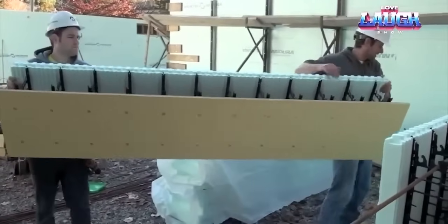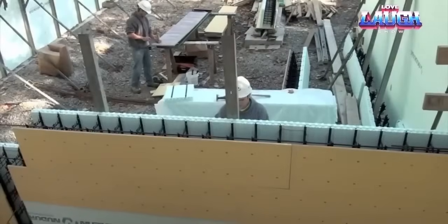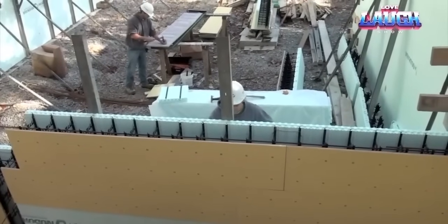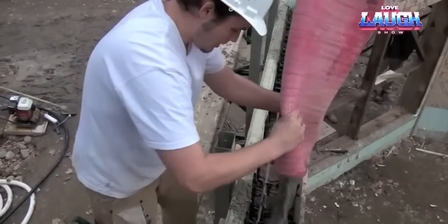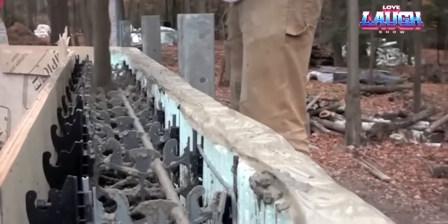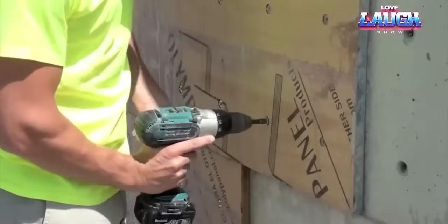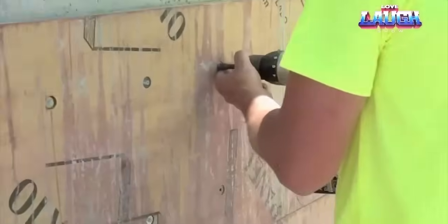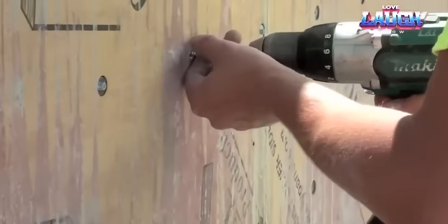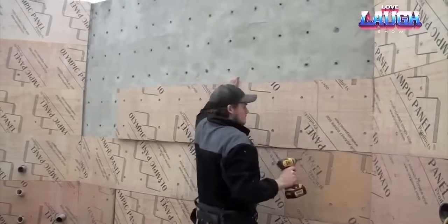Further, the construction process is reduced by one step. Workers are spared the need to remove the formwork after the concrete mortar has dried. Finally, since the formwork remains in the wall, it does not need to be disposed of, reducing the amount of debris left behind after construction. The use of permanent formwork has a positive effect on the performance of the walls. Styrofoam protects the bearing elements of the building from the environment and increases heat insulation. The construction itself is as strong and airtight as traditional wooden construction.